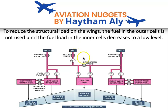This fuel supply design is divided into two sides — left side and right side — thanks to the cross-feed valve, which is normally closed. The left engine is supplied by the left set of pumps, and the right engine by the right set. The APU is also supplied from the left-hand side supply lines.